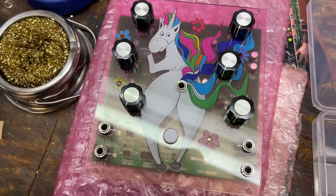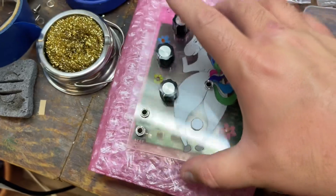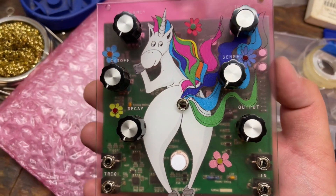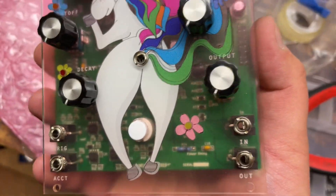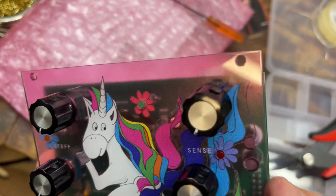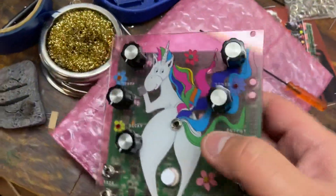There it is, all done — nice and shiny, knobs on. I really hope that power connector's on the right way; judging by how everything went today, might blow this thing out. One thing to note: don't screw the nuts under the knobs or the jack nuts on too tight, because this is a plexiglass panel and it will crack. Also up here, there's not much material between the screw and the end of the panel, so that will crack as well. Overall, happy — glad it works.